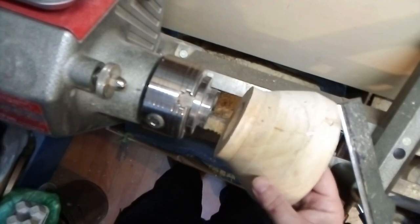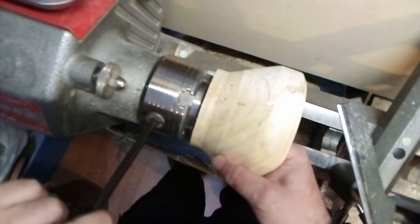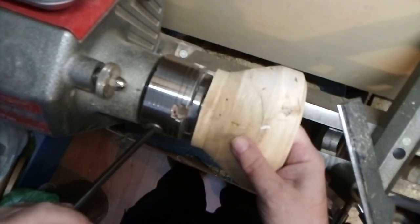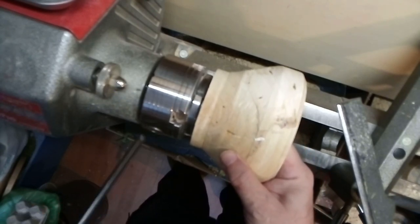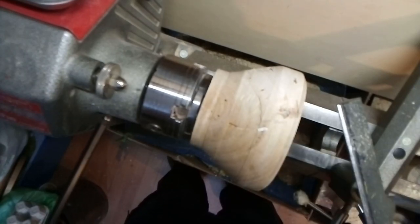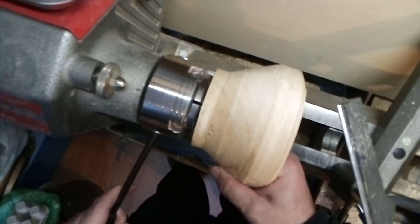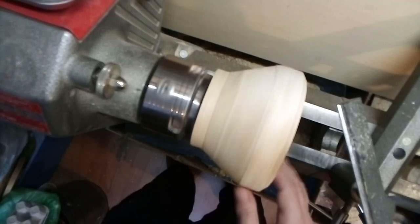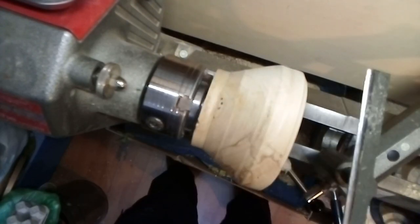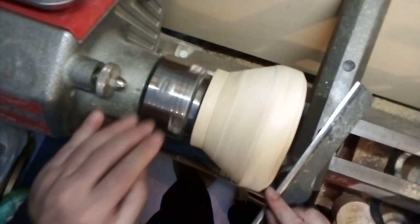How does this translate to large bowls when they give us problems? Well, I'm going to intentionally create an off-center situation so you can see why. And how does that affect things? When we turn it around I introduce this off-center. Imagine it moved on me, but I attribute it to other problems — the wood or someone passing by. And then this face here, which as you can see is wrong — perhaps it has been exaggerated too much.